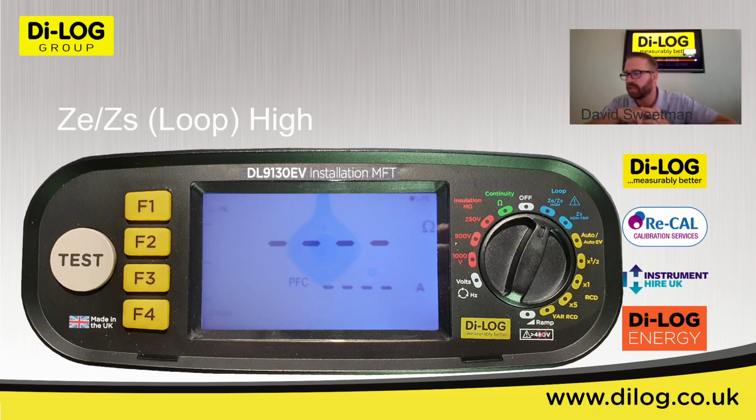It's intelligent, it knows exactly that as well. So we're set for prospective fault current. Press F1 for prospective short circuit current. That's tested between live and neutral, or fault current between live and earth.